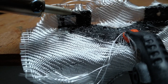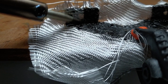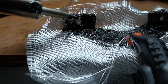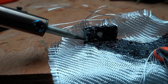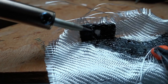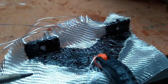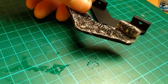What I'm doing is essentially melting the plastic through the fiberglass cloth. If you've worked with fiberglass and epoxy, you'll know that situation where the fiberglass cloth disappears and becomes transparent as it wets out — you're aiming for that level of melted plastic coming through. I didn't get that right on all of this piece, but this last corner I was getting to the point where I dialed it in correctly. I used a 40-watt cheap iron — don't use your best soldering iron. The results are an incredibly strong, if slightly ugly, workpiece.